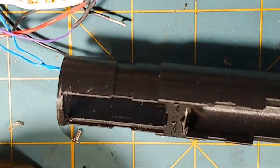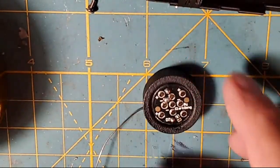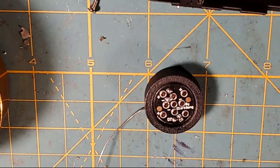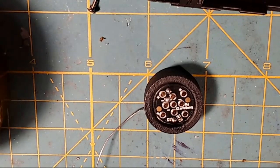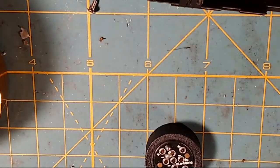I'm going to try and zoom in a little bit more, and then we'll try and get you guys in frame. All right. There. So there's our NeoPixel PCB, and now y'all are zoomed in. You're not going to see this, but I'm stripping wires off screen, only stripping just enough to go to the pads, and that's it. I don't strip any more than I need, and then I'm going to dip that wire in the Fluxorama, and I'm going to have all my wires going in the same direction, I'm hoping.